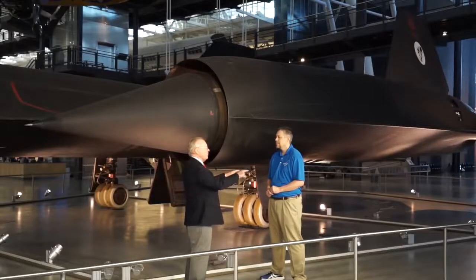It could be so violent, on one of the flights during an emergency, my sun visor on my spacesuit was broken when the cockpit hit me. I mean, the airplane was violent. So what they developed was when one inlet would unstart, the other inlet would sympathetically unstart, so both spikes would come forward, and hopefully you'd keep symmetrical thrust.